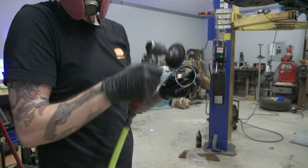Stepping back and taking an overall look at the exhaust, you might notice it's only tacked together. I left it in a tacked state before I left North Carolina — I just didn't have time to pull it apart and properly weld it all together. I really like to take my time welding an exhaust together; it will save a lot of headaches down the road. Weld a little bit, step back, let that cool off, go to another weld joint. Having a ton of joints allows me to jump around and let things cool in between. If you go hog wild on some joints, even with a nice butt weld, it can move and really change the orientation and angle of your exhaust.